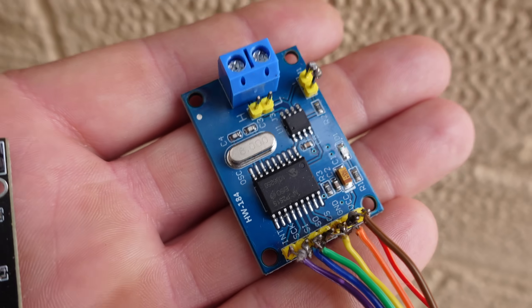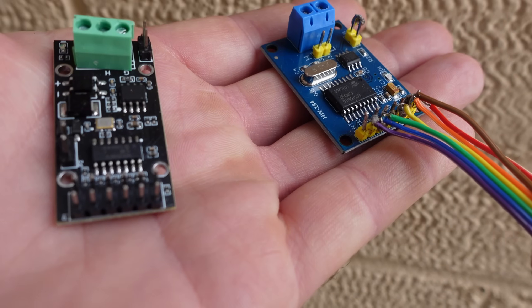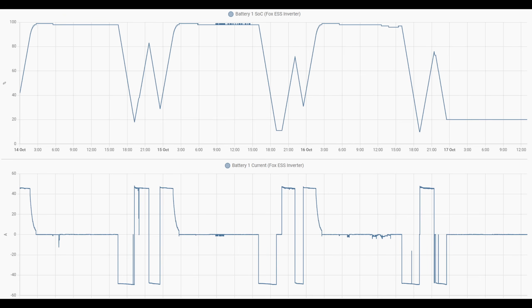Another communication issue I faced with this battery — once we'd given up on the two Lilygo boards, because they were known to have some issues especially when trying to diagnose a bigger problem — we switched to an MCP2515. A board I hadn't heard of up until that point. I had two of these boards which I purchased off Amazon. Could I get them working? No. I ended up buying another one off an eBay seller while I was waiting for some different boards. I tested that and it worked — we were able to consistently communicate with our inverter.